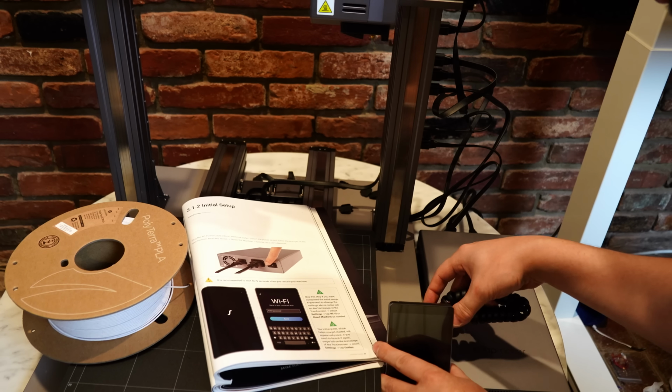Also, there's the issue with the filament management up at the top, with it tending to get wrapped around that side support, because the printhead moving up and down causes too much slack. That's kind of annoying. So really, where this machine should stand out is the laser cutter and CNC capabilities.